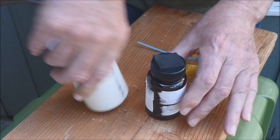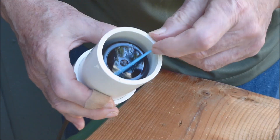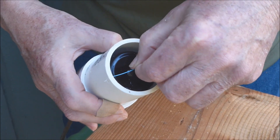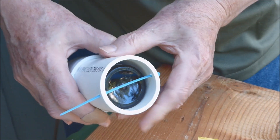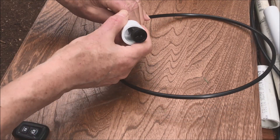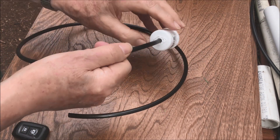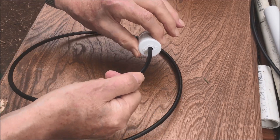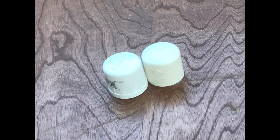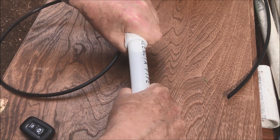It's time to make some working models of these float valves. As a starting point, let's take a brief look at the bottle model float valve that was shown in a previous video. It resembles a dipstick float valve but its body has a larger diameter. The first float valve model will also have an end cap with a hole drilled in it. The polyethylene tubing and button dripper are threaded through and snugged up. End caps are available in both a domed and a flatter top design; I prefer the flatter top design. The float valve body is inserted into the end cap and it doesn't need to be glued.